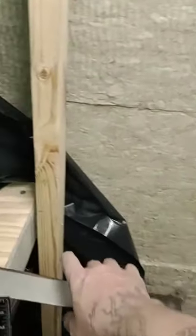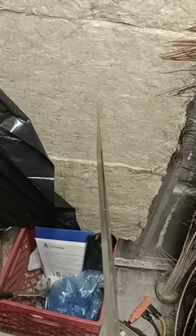One real quick tip if you've ever wondered how to cut rock wool - the simplest, easiest approach and the best method I've found is to go out and get yourself a machete. It doesn't have to be perfect, it can be old. If you look at the point, it's not the sharpest in the world, but you see how I'm sawing back and forth - and you can hear it cut.